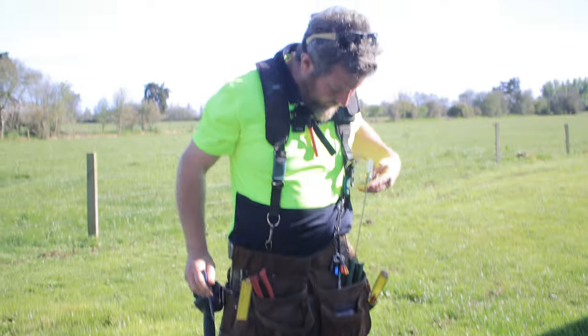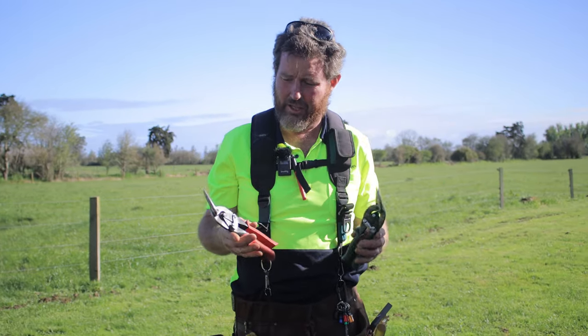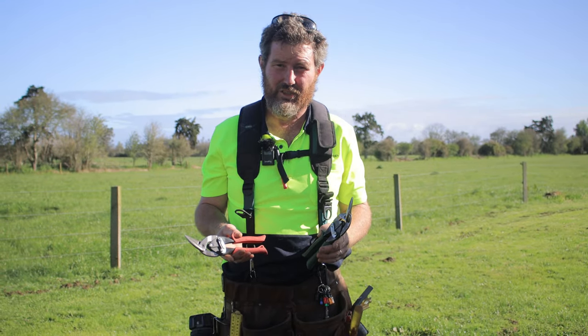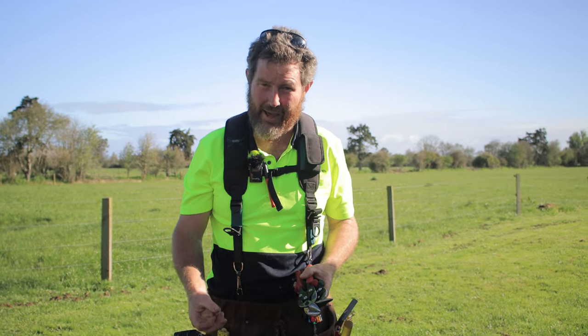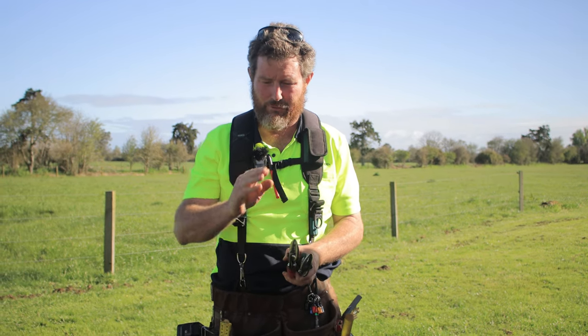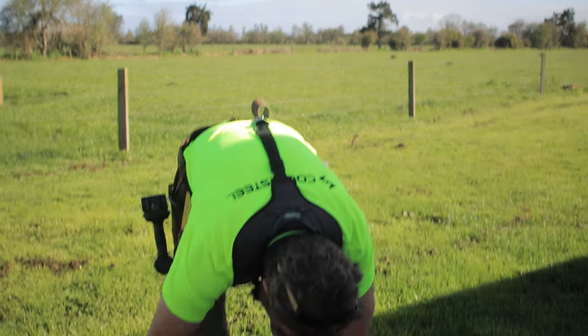So then I'm just using my reds and greens, as you've seen through the shed. You can build a whole shed with these as far as cutting goes. Some people might think, oh, why don't you use an angle grinder? An angle grinder will heat up the paint and ruin the protective layer, where these, as they cut, fold it back over and keep that protective layer. So they're the best option.